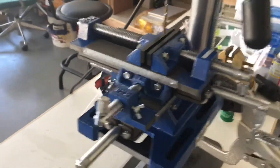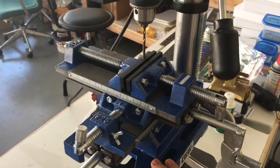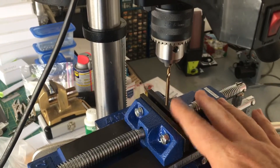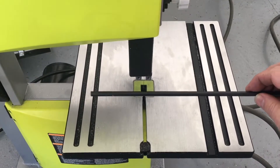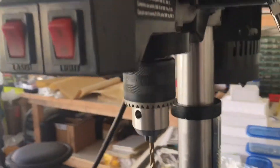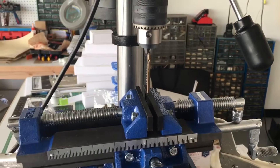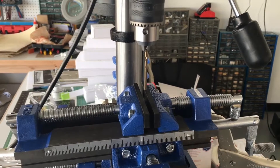We're going to play machinist here. I've purchased an adjustable vise for the drill press that allows me to place the drill bit in upside down, which will let me center it in the clamps. Then we'll cut the tube to size and run it up inside the chuck so I make sure to get a nicely centered and aligned drilling of the inner diameter of that tube. Let's go see how that goes.